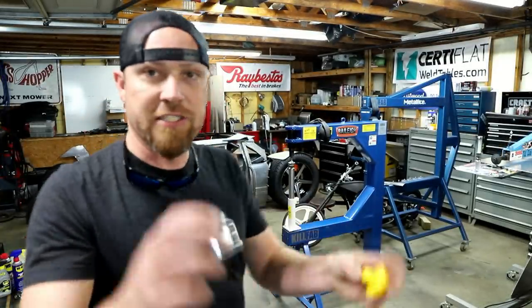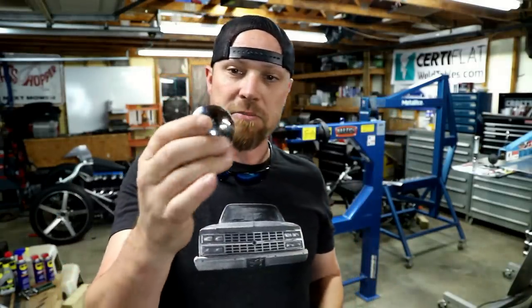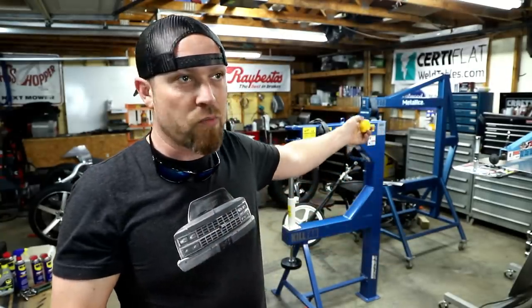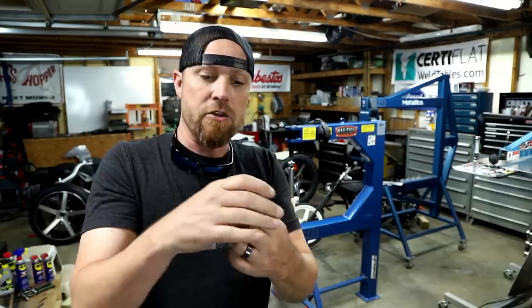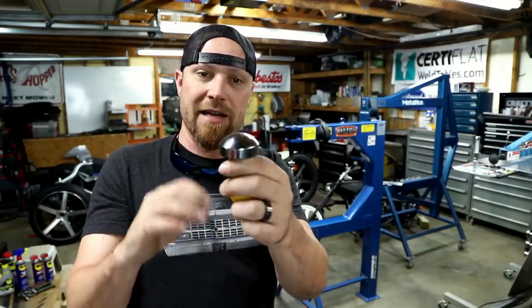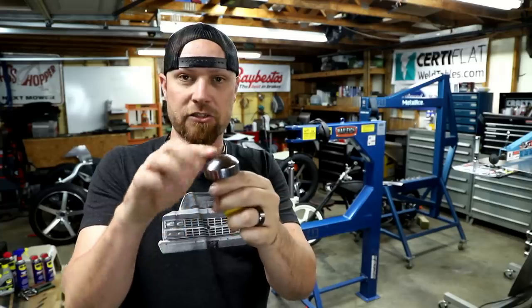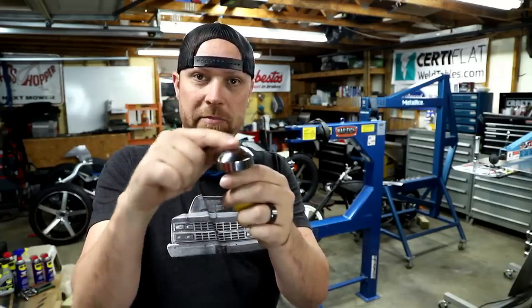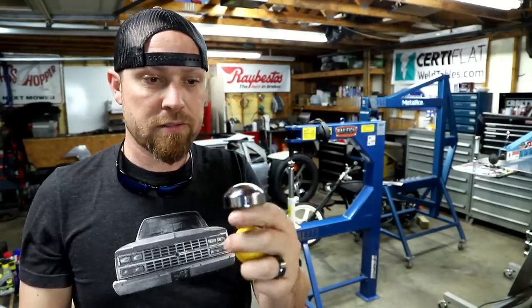And you have the ability to change the dies on the bottom, so you can use like a hard die or soft dies, depending on what you're working with. I like to use these for aluminum. These will be for your steels. And you can change the contours, very similar to what you would do on the English wheel. Depending on what you're trying to planish, you kind of match the contour of that with the die, mainly because you need that contour in order to fit a round panel over it. If you were doing something flat, you'd want more contact patch. You get more work done faster. So yeah, that's the basics.